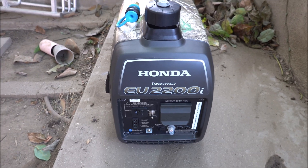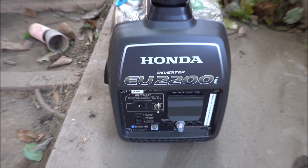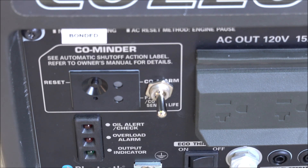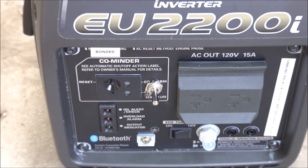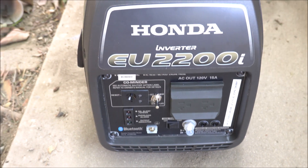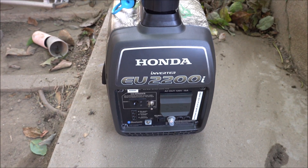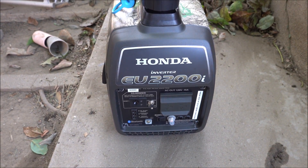Here's a quick video on how you can bond a Honda 2200 with a 30 amp toggle switch. Down is for unbonded and up is for bonded. Connect one end to the neutral and the other end to the ground, and start it up.